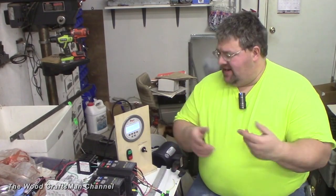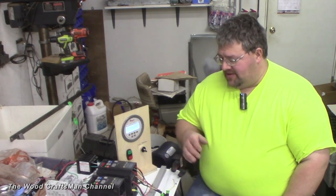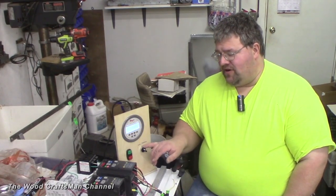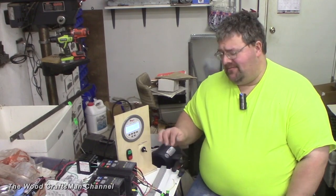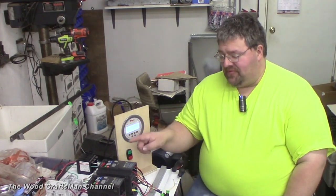That was kind of it — I just wanted to go over this. It actually looks like a lot, but I got a lot of support from the guys at Automation Direct. They have a really good technical support department and were able to help me get this wired up with the 4 to 20 milliamp signal. The only thing I couldn't figure out was how to get it to do manual and auto — they just had me add another switch. The manual is very overwhelming.